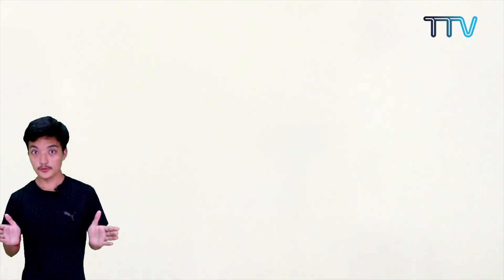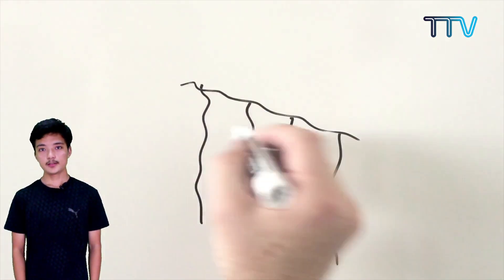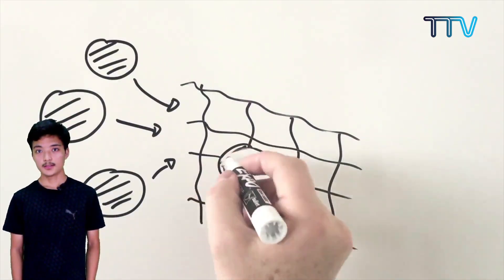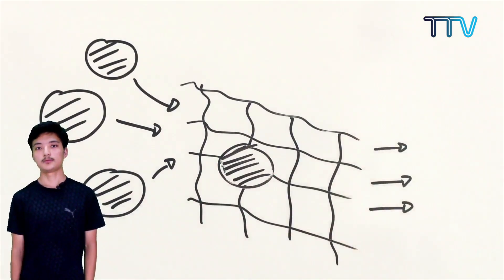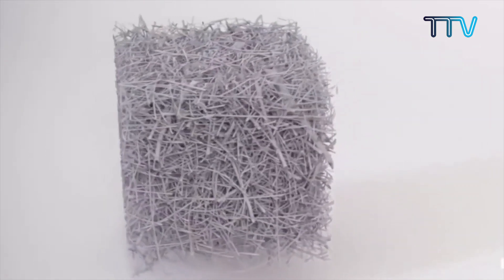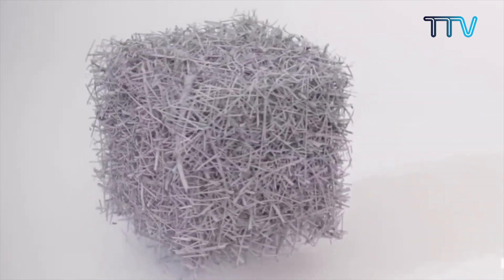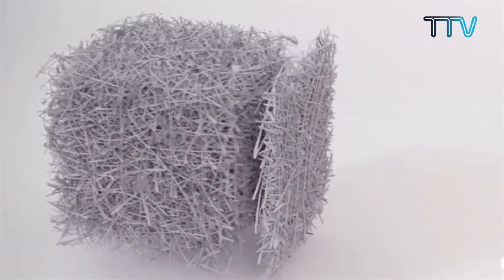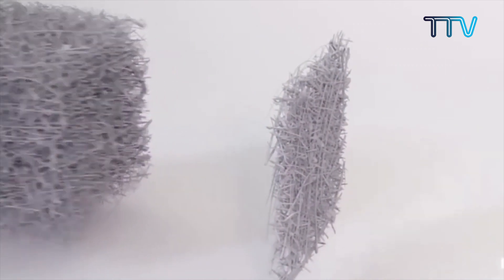I have explained the procedure simply to you, but it is way more difficult. We faced many difficulties, and we had to redo many things. Most of the people think that, in a filter, the large particulates are filtered while the smaller ones escape. However, this is totally a misconception. In HEPA filters, there are a number of glass fiber layers in order to complete the filtration. These consist of very thin fibers, distributed randomly, and orientated at all sides.